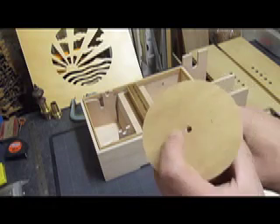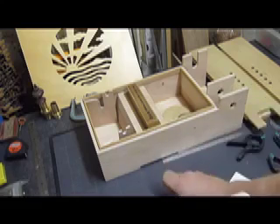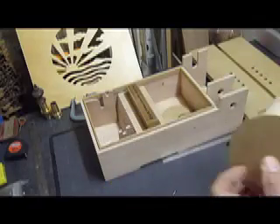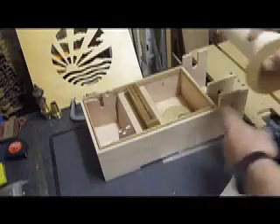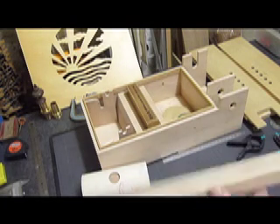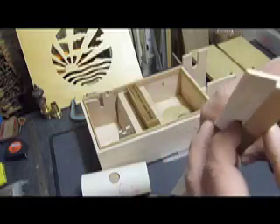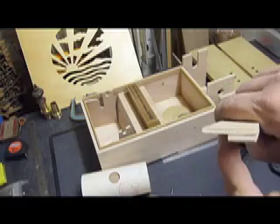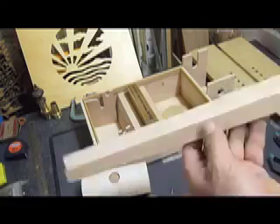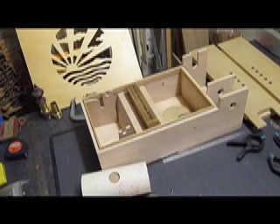I need to match up the two spool ends. I will put a little brass screw in the middle — the head of course mustn't stick out further than the ground of the spool — ready to clip the music on. The spool will go in the box with its drive wheel on the edge to drive the busker. The other job I've done is to make a bracket by passing a band of plywood over the blade of my circular saw to gouge out a channel. The circular saw is good if you set the depth gauge and just route out the bit of wood.